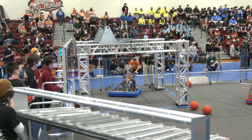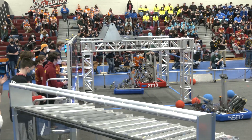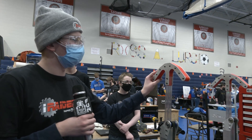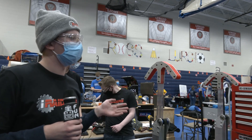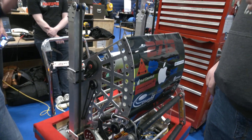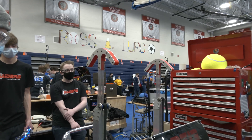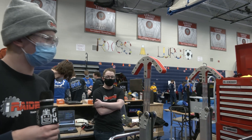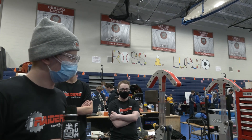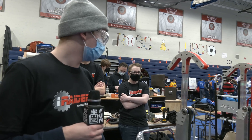We've seen a lot of teams going for the mid-rung use a climber-in-the-box solution. Why was it important to your team to make a custom setup? We felt it was good to have knowledge for future generations of students who know how to do custom parts. At the top we made a double hook, so in the perfect scenario we could drive onto the bar centered on the center of gravity — that would be the most even climb so we'd have to move up the least to get off the ground. But we also have it on the other side too, so worst case we could drive on that side and it would still work. A lot of our group is new to the team — sophomores and freshmen — so it was good for them to learn how to build these and not depend on pre-built or out-of-the-box climbers in the future.